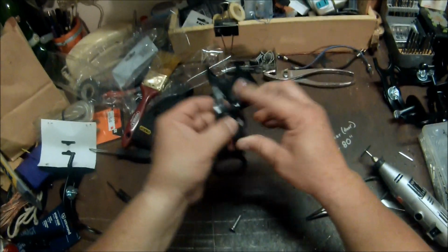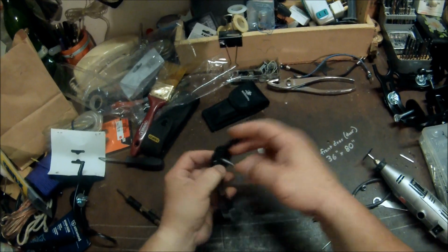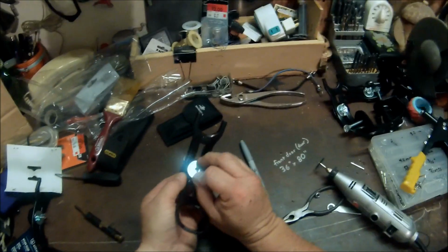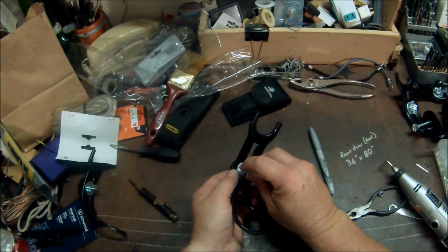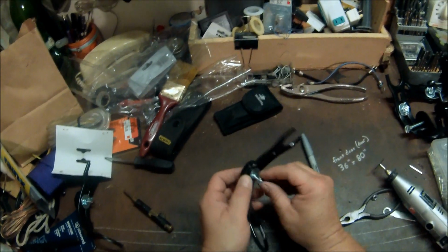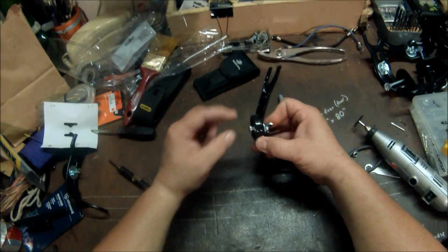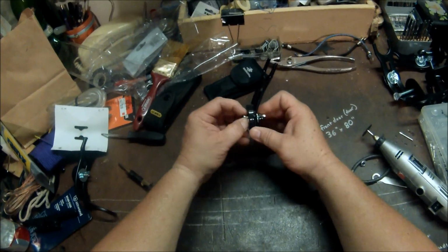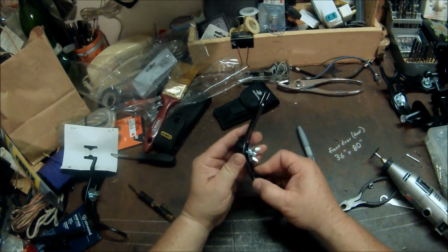Then you go ahead and assemble it, put your bolt in. On this side we have our washer. Use a lock washer and your wing nut. And what I'll do is take this out and it'll be something like this, and I'll slide this into the channel, and once I tighten it in, it'll keep it from turning, and I can adjust this.